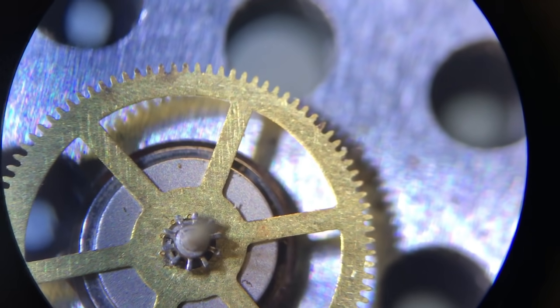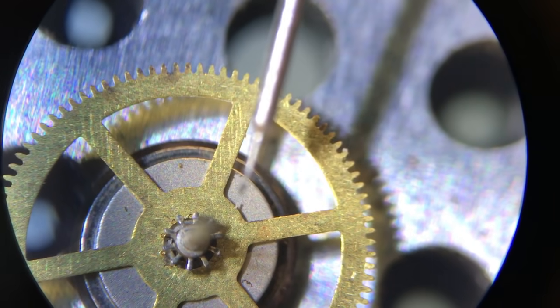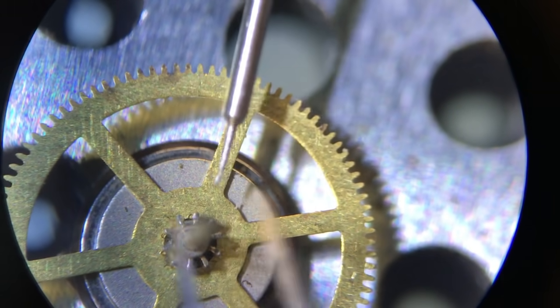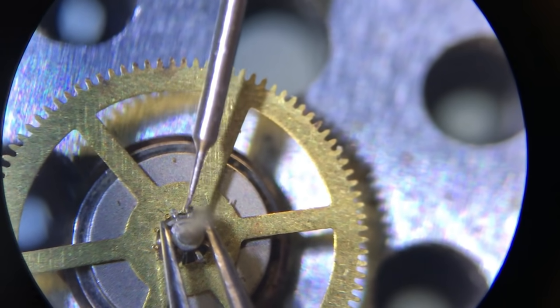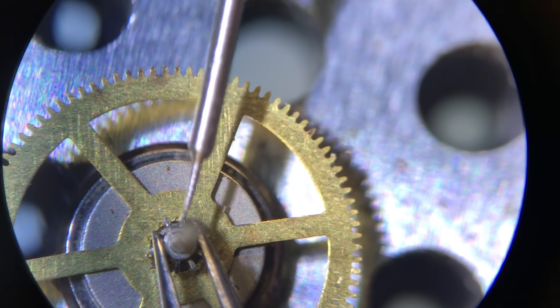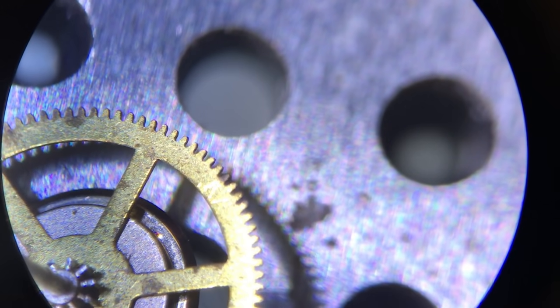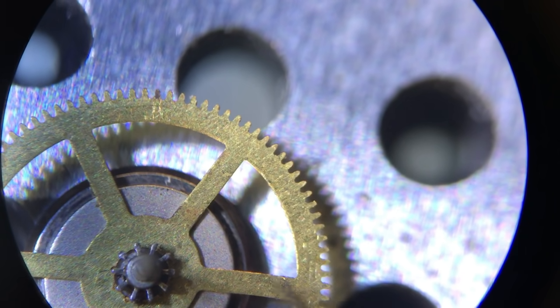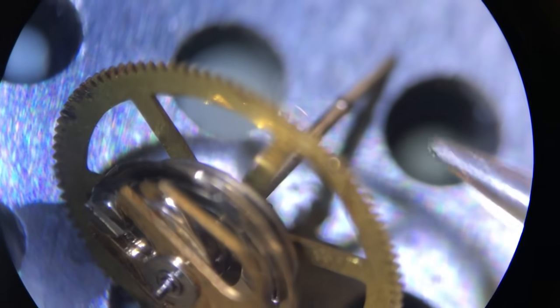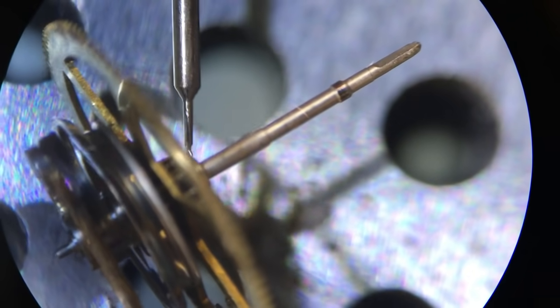And when that's pushed down, you need to try and get your oiler. So you'd need your finest oiler possible. And let's just see what we can do. So you'd push this down and you'd be trying to oil in between the gap, which is just sort of under there. Now I don't do this on the microscope, I do this under a loupe on my bench. I guess if we take it out actually and turn it to one side, I'll show you what I've done, but you are just literally trying to get a little bit of oil